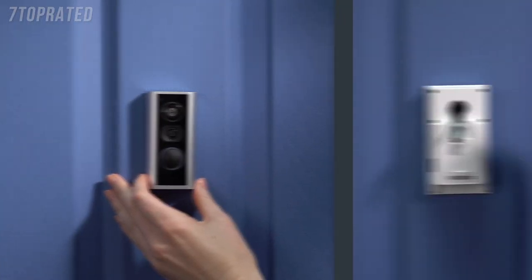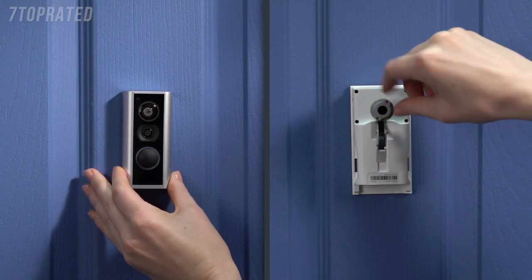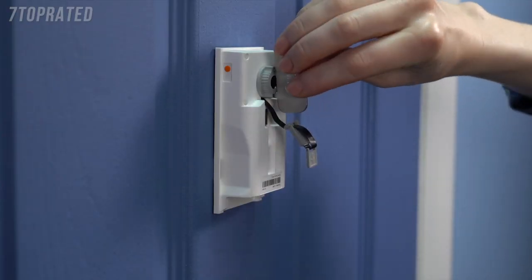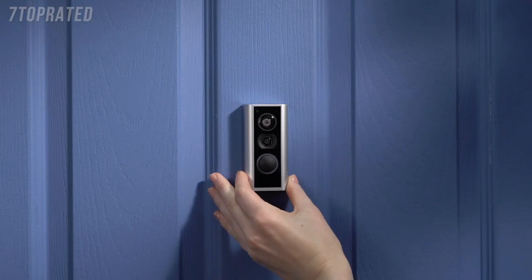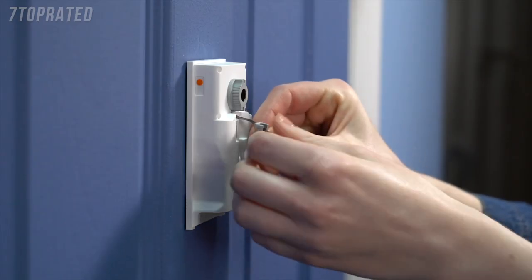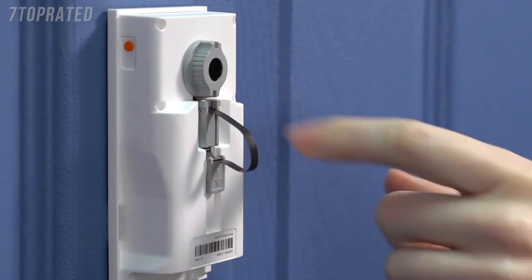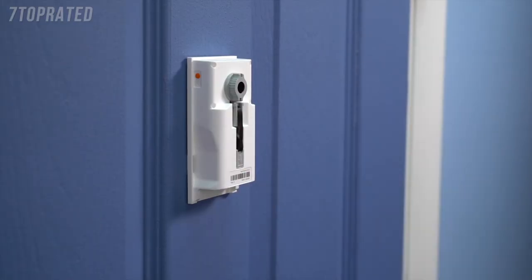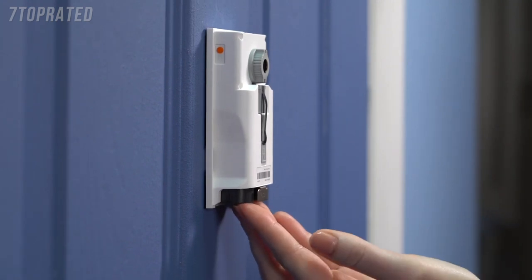Let's secure the front of your peephole cam. Place the tightening nut onto the tube, then tighten firmly by turning clockwise by hand or using the peephole key. Make sure it's secure enough so that it doesn't rotate freely. The front side may shift slightly while tightening, so make sure it's level. Next, firmly press the connector into the port, ensuring it's connected. Then guide the tab into the channel and slide it down to secure the remaining slack in the cable. Slide the battery into the compartment — there will be a click when the battery is secure.